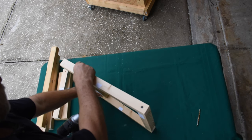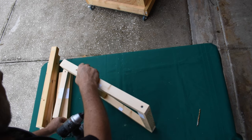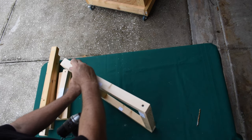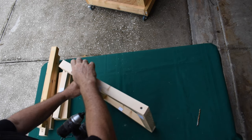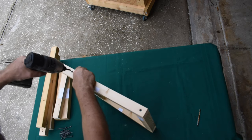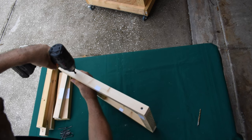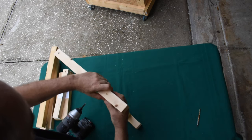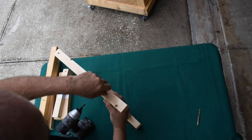You're using 2½ inch or 3½ inch screws. You want them nice and long to provide strength and stability. After we completely put the frame together and make sure it has good fit and finish, we'll take it apart and then apply some glue and put it back together again.